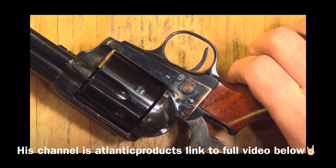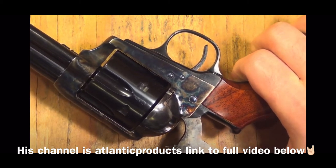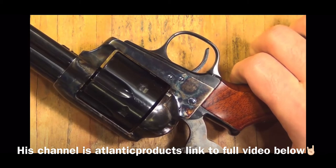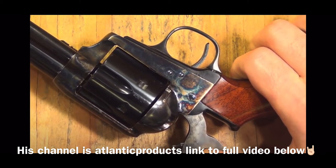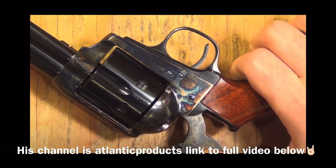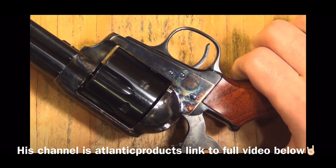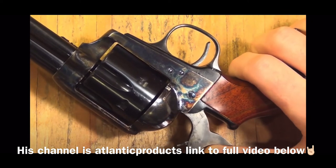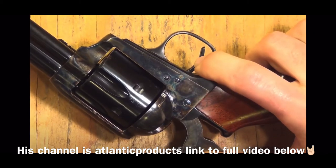Now it's in the notch, but the hammer's not fully cocked, so you can actually fall forward onto the half-cock notch, which would be bad. That could really ruin your sear and/or break the half-cock notch. If you just cocked it and then took your thumb off the hammer, it would slam forward into the half-cock notch. Not a good idea. You have to really pull back hard on the hammer to allow that trigger to set into the notch.